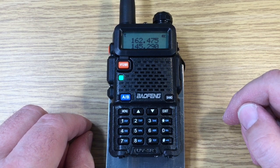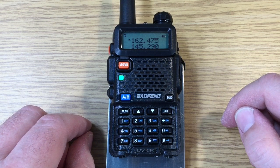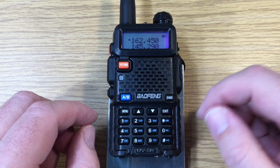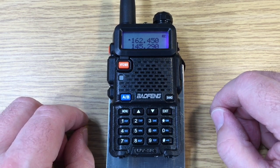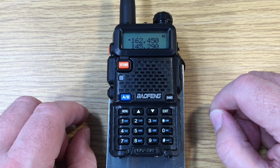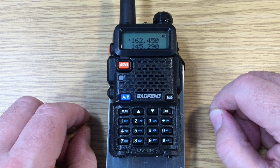For my current situation, a squelch level of one is satisfactory. Now, if you have more noise or depending upon the antenna and so forth, you may have to set the squelch level higher than one. In other words, you set it until the background noise stops.